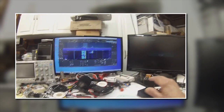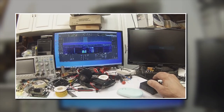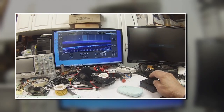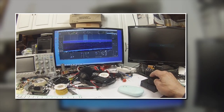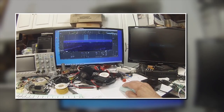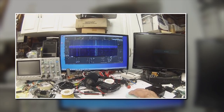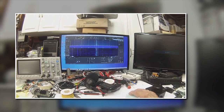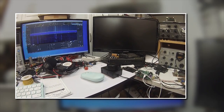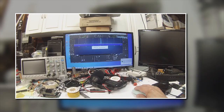The default — if you put it anywhere on the display — because it's set up at one kilohertz, it'll move at one kilohertz increments. So we're tuning across 40 meters right now. I'm using the Hermes Lite with Thetis, so it's not the homebrew rig but it's the Hermes Lite. We'll dial it in to FT8 — put it on digital upper — and we've got a few FT8 stations here on 40 meters. Pete here N6QW — the mouse wheel works on both Linux systems and Windows systems.